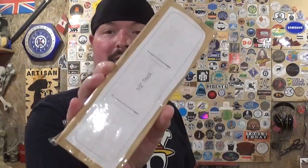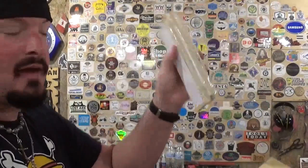Welcome back to the Workshop Artisan Empire. In today's scroll saw project video, we have another amazing and unique design by Steve Good. Once everything is cut out and assembled, we're going to have a nice little miniature diorama of a ship. I've already got all the pattern printed out and attached to the material wood with clear packing tape. The base needs to be more bulky — Steve suggests half inch, but I've got a three-quarter inch piece — and here are the two support structures for the base, which we'll probably paint a nice dark color.